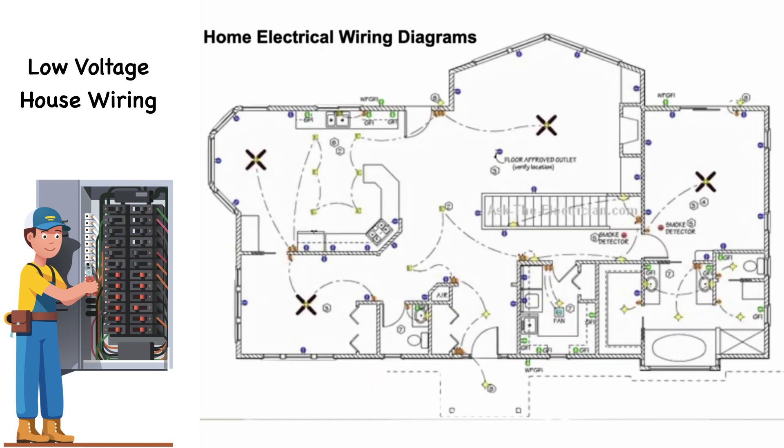A couple of comments regarding wiring diagrams and house plans: home electrical wiring diagrams should reflect code requirements, which help you enjoy lower energy bills when you implement energy efficiency into the electrical project design. A typical set of house plans shows the electrical symbols located on the floor plan but does not provide any wiring details. It is up to the electrician to examine the total electrical requirements of the home, especially where specific devices are to be located, and then decide how to plan the circuits. The installation of the electrical wiring will depend on the type of structure and construction methods used — for example, a stick-frame home consisting of standard wood framing will be wired differently than a log home because of access restrictions.